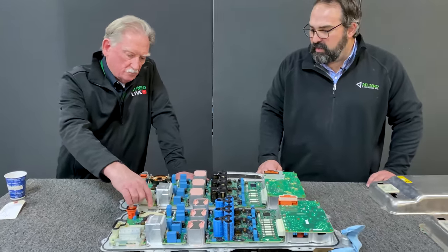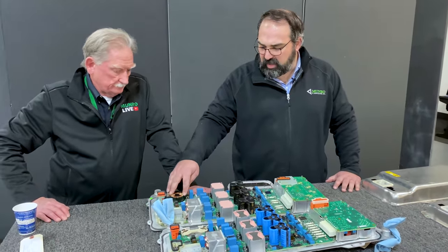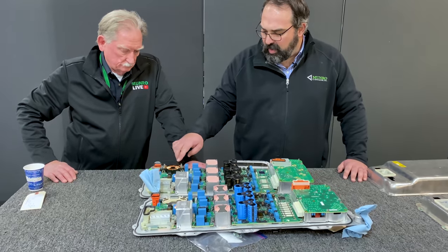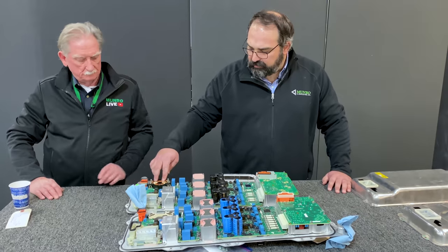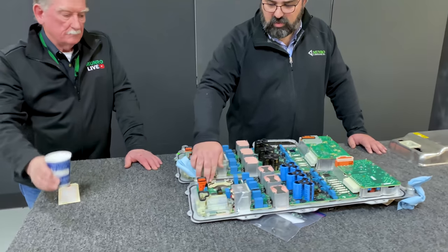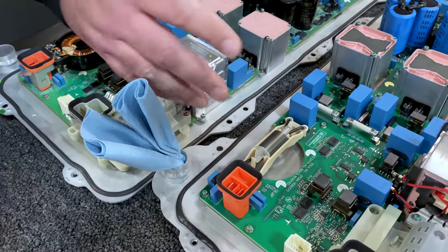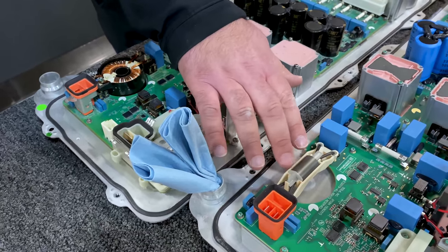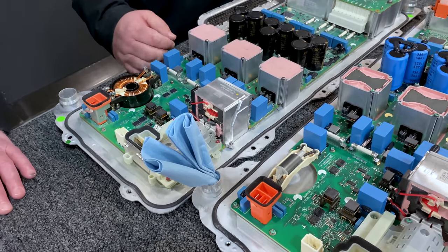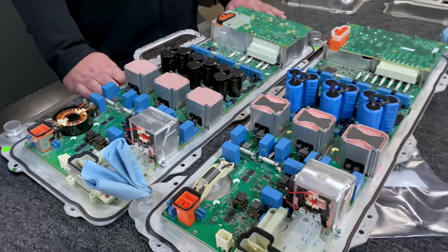This is the one coil that's taken the place of the previous design. The old inductor was a toroidal design with a pair of wires wrapped around a ring going down both sides. On this one, they have two wires just going through the middle of the coil — a much more cost-effective way of doing it, and a much lighter design. Why they were able to make this change in requirements, we're not entirely sure, but we think the additional transformers at the beginning have something to do with it.